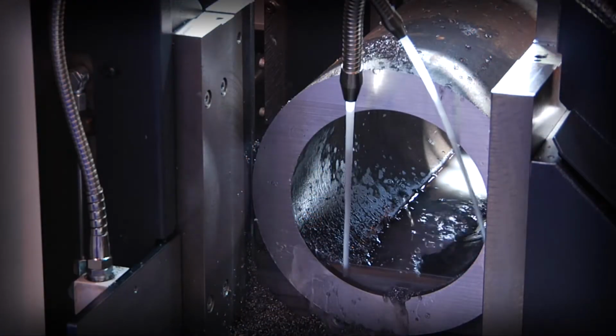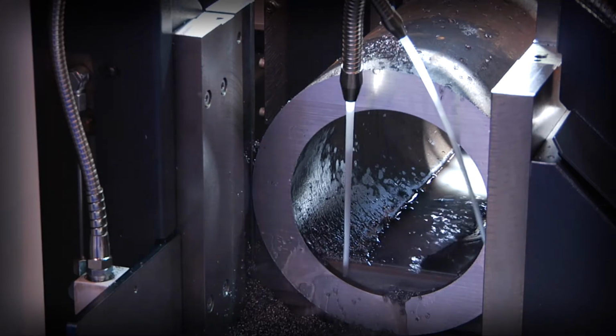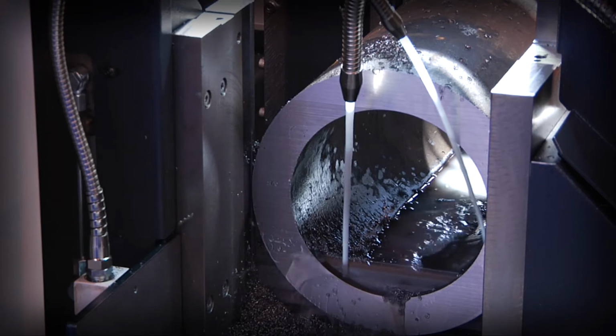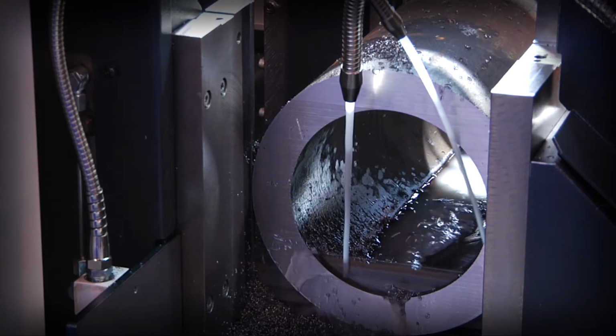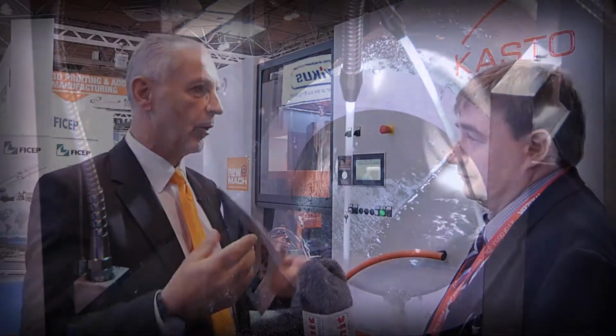Turning it upside down, coming from the bottom up, we're going upstroking bandsaw, the first one on the market, you make sure that when you come into the bottom of the tube, the swarf drops off the blade. This means you can cut 20, 30, 50% faster, but, now the big but, it's the first time you can cut tubing with carbide blades, because you are not damaging the teeth. And in a tool that is 4 times the price, you want to make sure that the efficiency and cost effectiveness is not tainted by the high tooling cost.